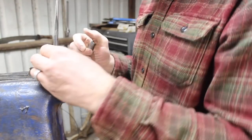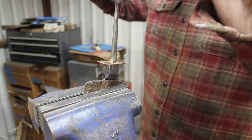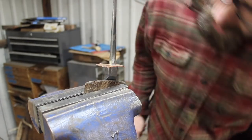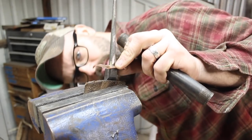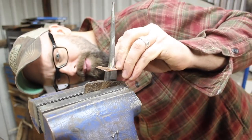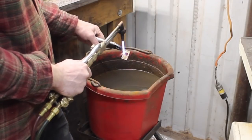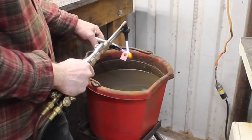Making a good blade out of 52100 is my goal here. If you use a dry ice quench, more power to you — it can only help. Essentially any hyper-eutectoid steel is going to benefit to some degree from a sub-zero quench. The question is how much, and is it worth it? You shouldn't have hardly any retained austenite to worry about if you're doing the heat treatment process properly.